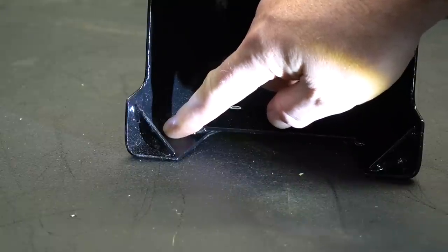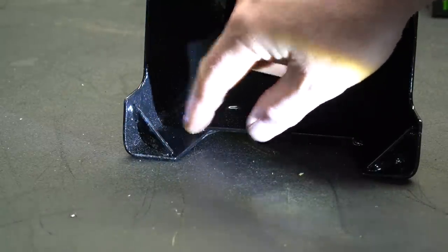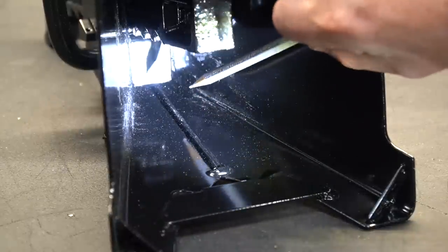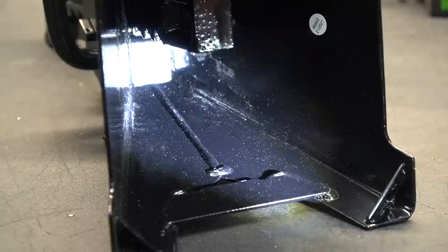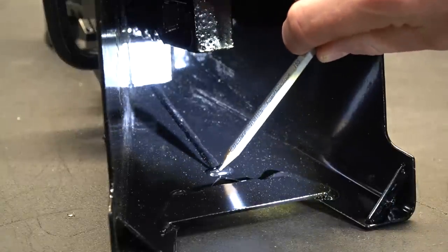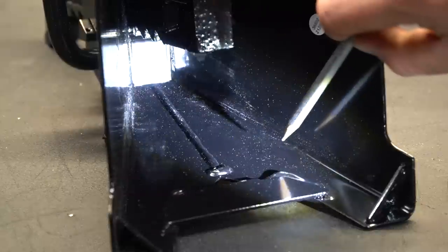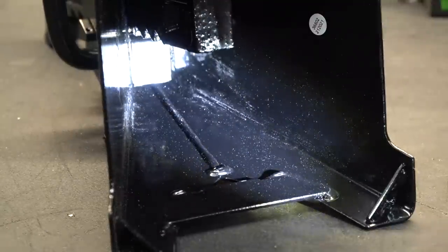The bottom corners of these stands have little gussets welded in, which is really good — when jack stands start to fail, the legs want to spread out and deform, and this gusset will prevent that. On the inside, I'm very impressed with the welds. They're pretty much perfect because they are machine welded. They also did something I've never seen before: they added a horizontal weld across the bottom of the vertical weld, which strengthens that area a lot by tying the two halves together. It's overkill since the bar is already doing the same thing.